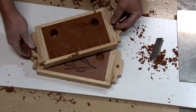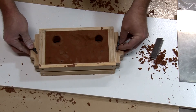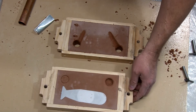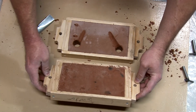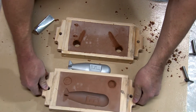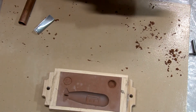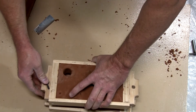Assembling the flask, I make sure to do it very gently so none of the sand breaks loose and falls into the mold cavity. I still need to make those F-bomb molds for my friends. This time you can see the two little holes back at the fins that I put for air holes, so the aluminum could flow back into the fins. I'm not going to show the whole packing of this, just enough to let you see how I put it together. There it is, getting buttoned up and getting ready to go.